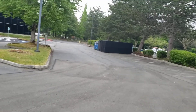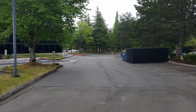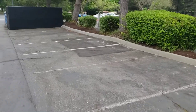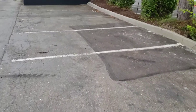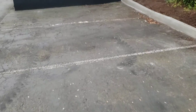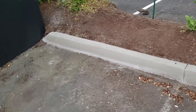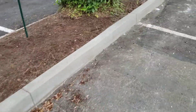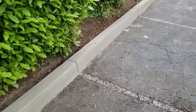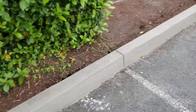That first section over by the fire hydrant — the radius over there on the south side of the building — is the only area where I've seen that cracking. The mud still looks kind of wet right now, so I don't know if maybe there's too much water in it or why we weren't getting compaction. But all of this curb I just walked down — this section looks really good, super consistent, nice curb breaks, and they aren't pushed in too hard.